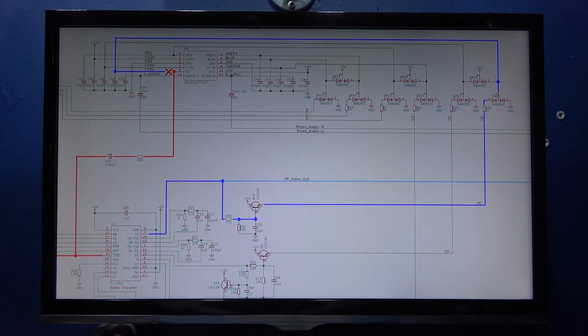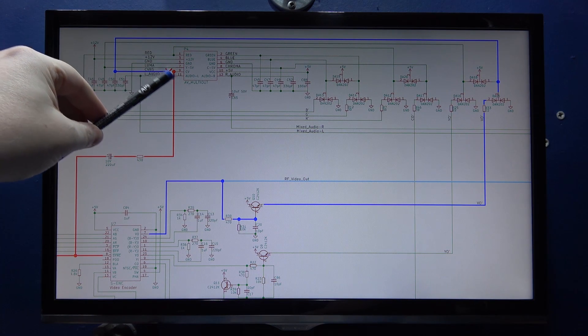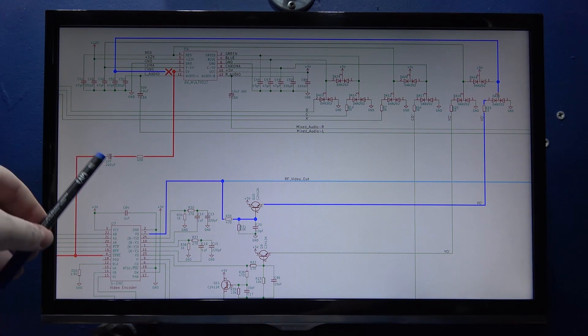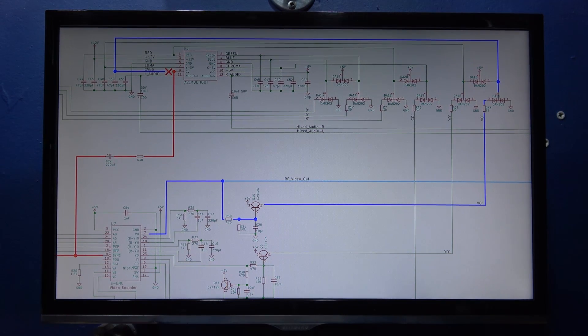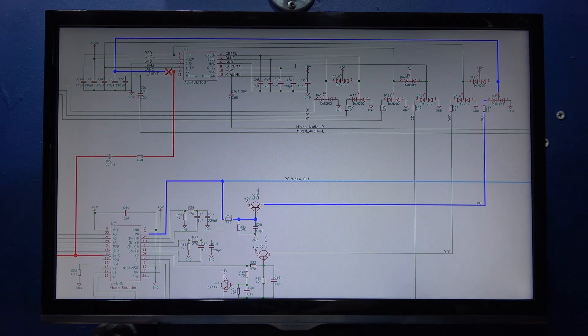The mod we're going to do is very simple. I'm going to come in and disable composite video going to pin 9. I'm going to take the CSYNC signal and tap into that. I'm going to send it through a 220 microfarad electrolytic capacitor - that will kill off any DC offset if there is any. Then I'm going to go through a 430 ohm resistor to attenuate the signal, and I'm going to go straight to pin 9. That should wire in CSYNC and hopefully get rid of the horrible dot crawl, and we should have a really nice picture when it comes to RGB output on our SNES.